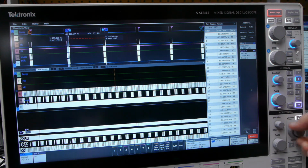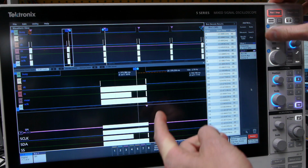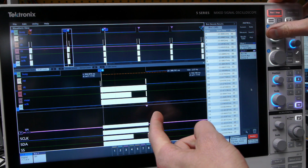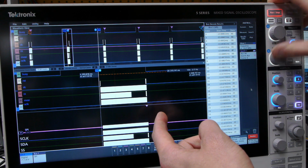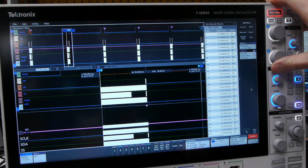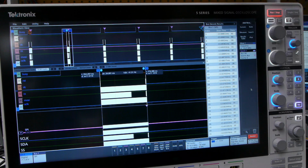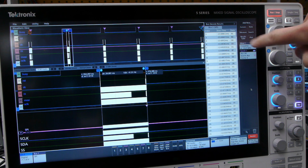So if we look at this thing a little more carefully here, we can zoom in on it. So then looking at the zoomed in section, I'll use the cursors to measure the time it takes to actually send the stuff to the display. So 24 milliseconds out of the, what did I say, 200 or 300 or whatever it was, is actually taken up just by the SPI bus. And in fact, we're cranking really fast. It's doing about 14 megahertz is what this thing is measuring here.